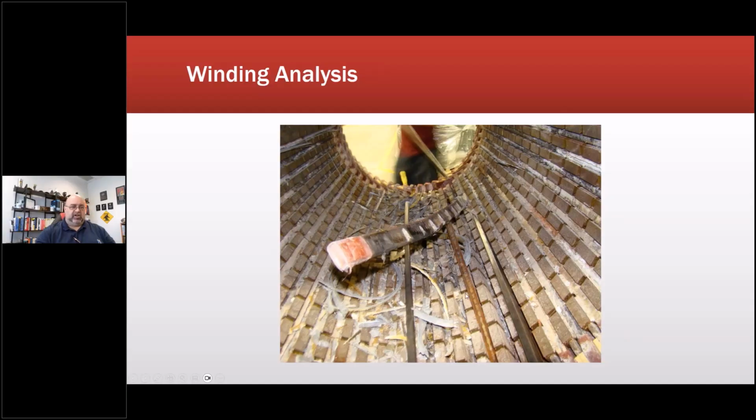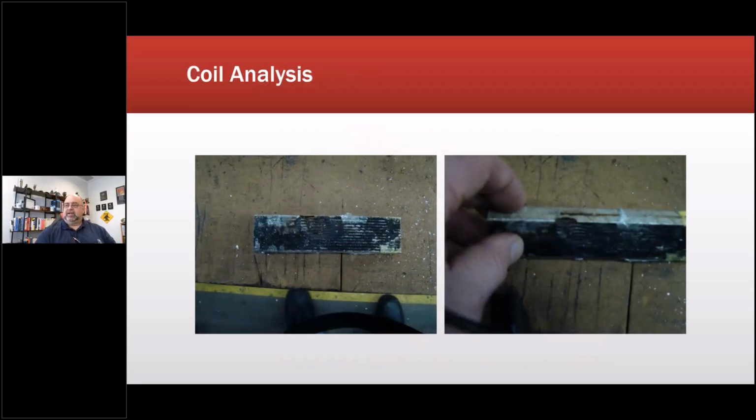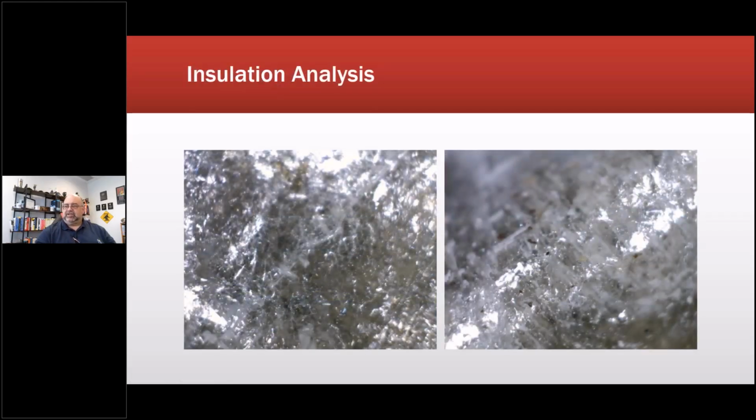Then the material would collect along the edge, and there's an effect called magnetic termites, where the ferrous material will actually start to spin and drill its way into an insulation material. This is that spot. Those are my old steel toes. This is where the short to the surface is, at the edge of the corner right at that failure point. And these are actually bits of the ferrous material at different layers eating its way in towards the coils.